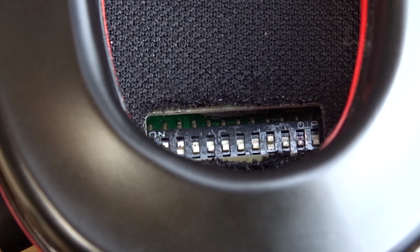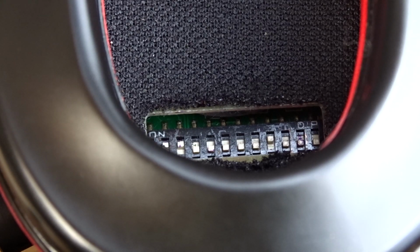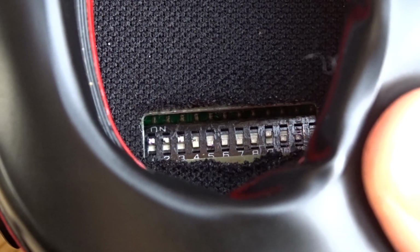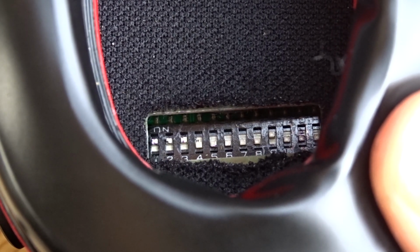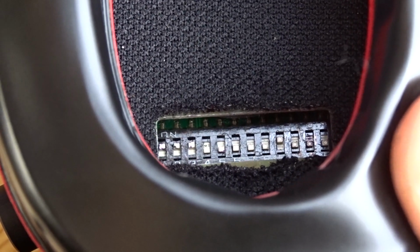So it has to be noted for this headset, apart from turning dip switch 3 on for the side tone, that feeds the audio directly out to the GoPro audio lead, no other settings on here will affect the GoPro's audio. That's hardwired into the circuit board, and only MicroAvionics can adjust that. I've got dip switches 1 and 2 on, and that increases the mic gain to reduce wind noise, but it does reduce the bass quality of the music if you are listening to music through the headset.